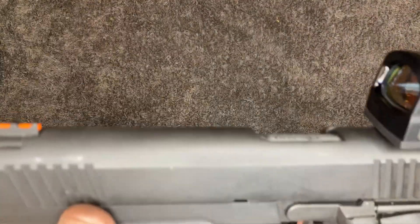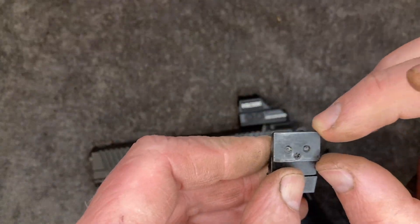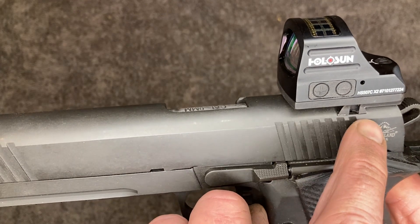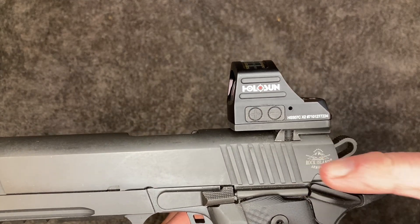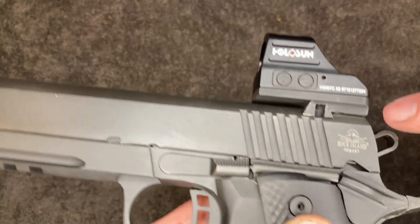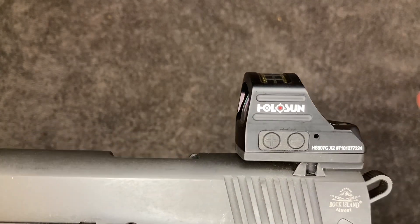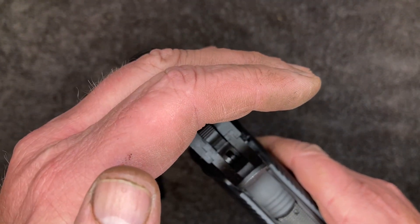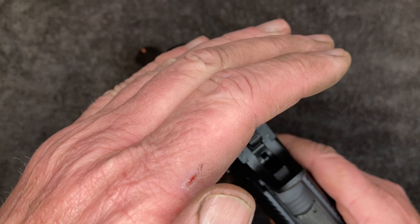Got it on. The old dovetail width was 475 thou, and the width of that plate was 488 thou, so I took down the bottom of the plate until I got to the correct width. But then I didn't have clearance between the plate and the slide — you can see a bit of silver in there. I had to take material away on that plate so it could clear. Also, the plate was shaped such that I had to remove material on both sides to get clearance across.